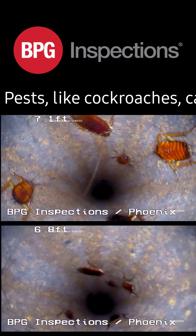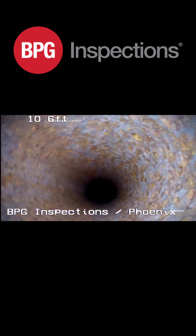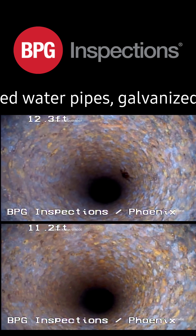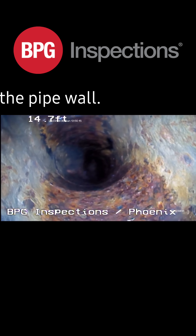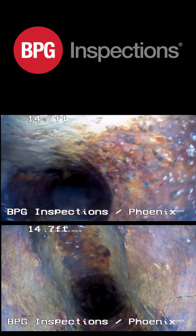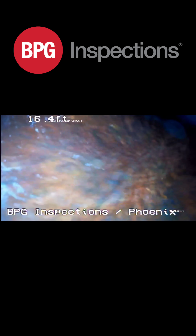There's debris — lots of it. It looks like there's a lot of pitting. It kind of looks like galvanized to me. That's where another drain hooks up to it, and that's where our hallway sink is going to go into the drain system. Let's see if we can follow this up to the street.